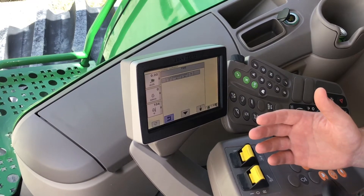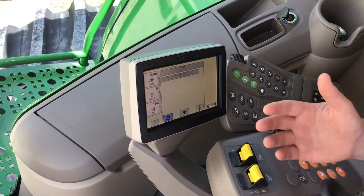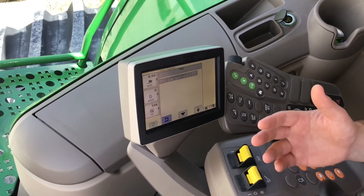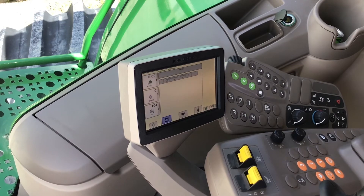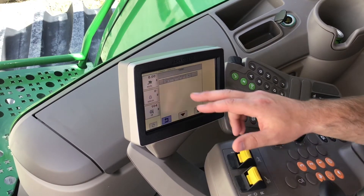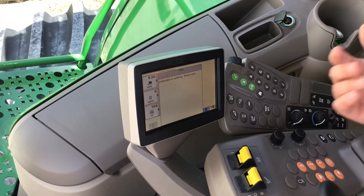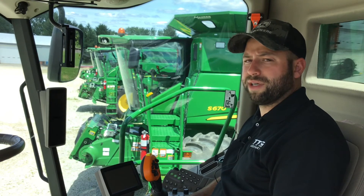You'll want to do this up to seven or eight times at different speeds. I recommend at least two loads at around two miles per hour, two loads at three, and two loads at four. We're trying to simulate different flow rates for the mass flow sensor. Once you've done all of them, you have your actual weights, type them in, check-mark them, then hit the triangle button and it will update your calibrations.